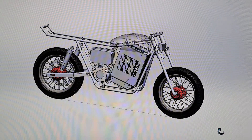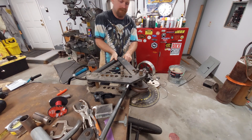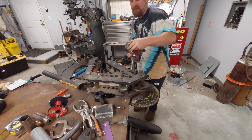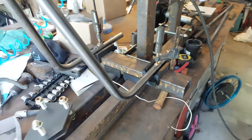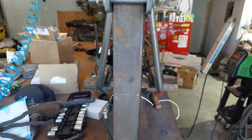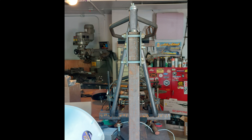I've done some CAD and I'm going to bend up some tubes using the JD square bender. This is one-inch diameter, 0.095 electric-welded tubing. I'm putting everything up in this jig — I actually made a video for this jig, you should go back and check that out. Everything's looking really nice; the CAD helped make all the clearances right and make sure all the parts could still fit.